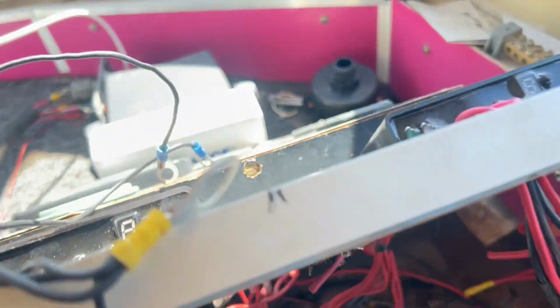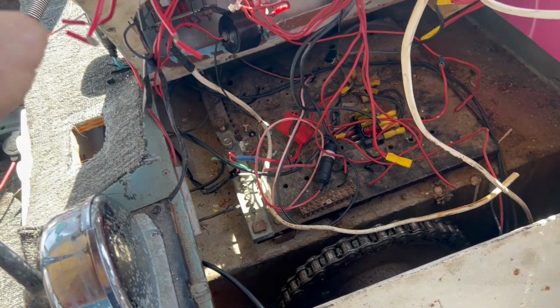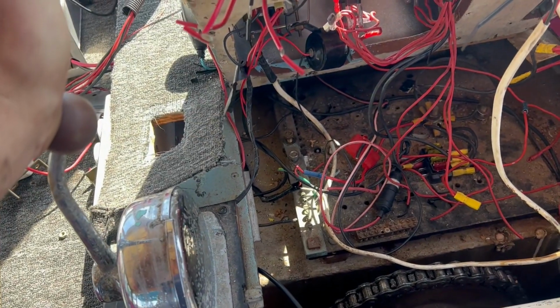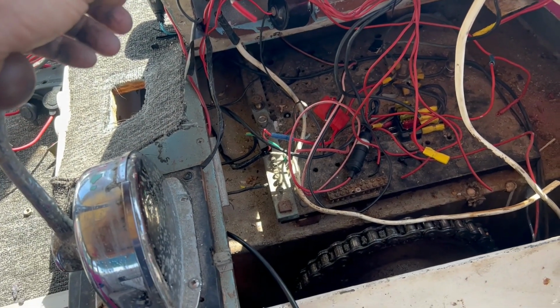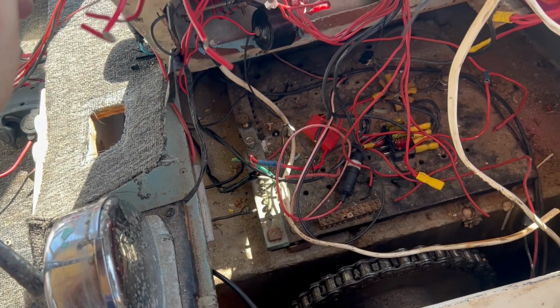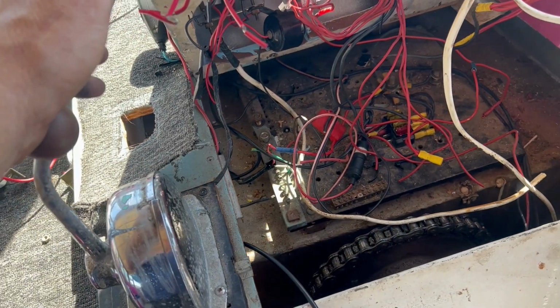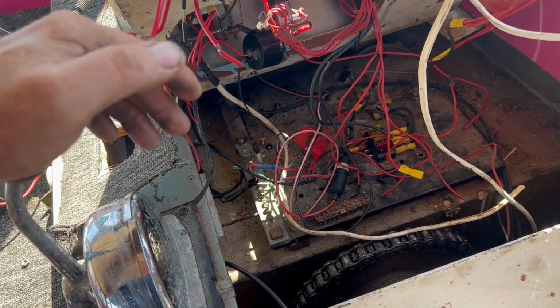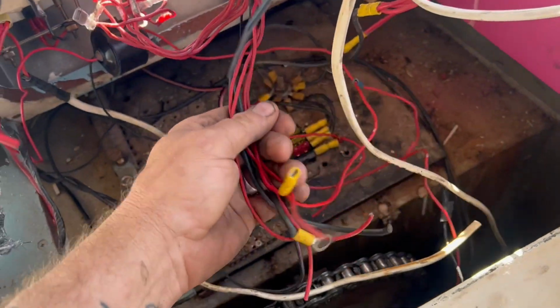I don't want an amp meter, I just want a volt meter, gearbox temperature, engine oil temperature, engine temperature, oil pressure, and an alarm for those two. Then my bilge alarms, which I've got to have, and all my bilge wiring, which will go down, and fresh water pumps. So we'll try and keep it as simple and as tidy as possible.